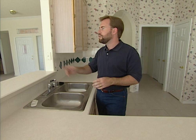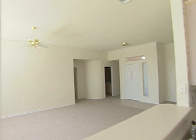They're also going to check all the sheetrock to see if there are any major cracks. Minor cracks are okay — that's just the frame expanding and contracting. Major cracks could be a sign of a serious foundation problem, which would mean a big bill.